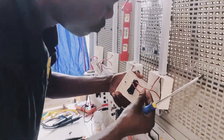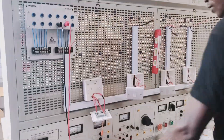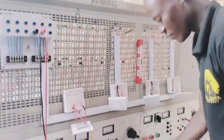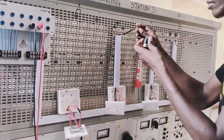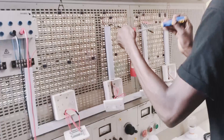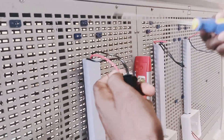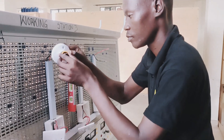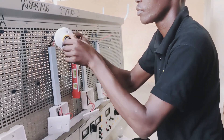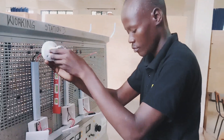The black-taped wire is live two on the other switches as well, and the remaining one just becomes live one. The common of the first two-way two-gang switch serves as the power input. The common of switch two goes to the light together with the neutral from the circuit breaker. The same applies to light switch three with lamp two — the common from switch three, which is a two-way one-gang switch, goes to lamp two.